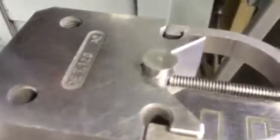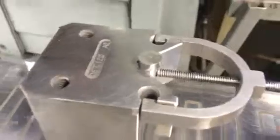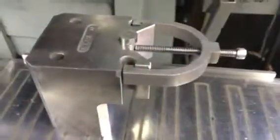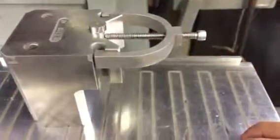And there you go — it's all prettied up. I've got a little witness of the turning still in the center, but that's okay, it's good enough. I'm going to do all seven of them, then use that face as my new datum to grind the top. I'll show you when I get there.